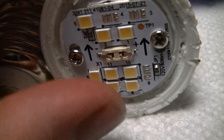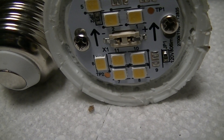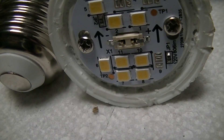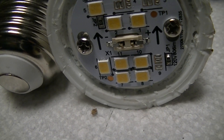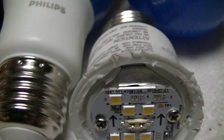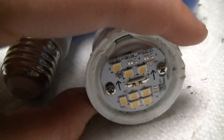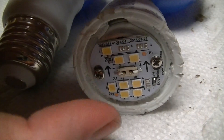Some of these LED lamps don't have 8 of these — they have 40, all in series, with 120 volts DC coming out of the supply, which can electrocute you fairly easily. So this is not something I'd recommend doing to any of these lamps anywhere where people can touch them.